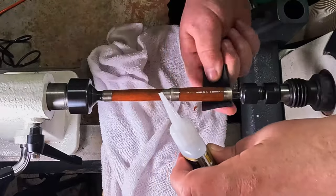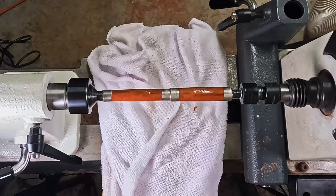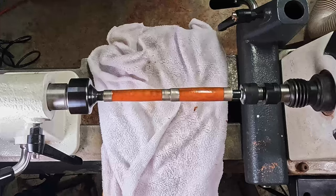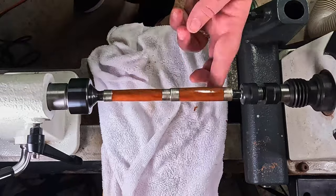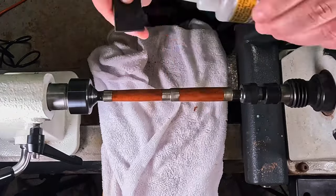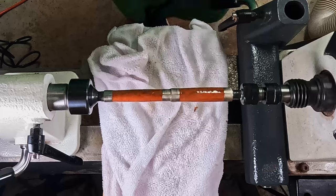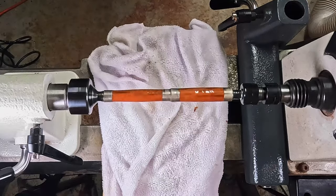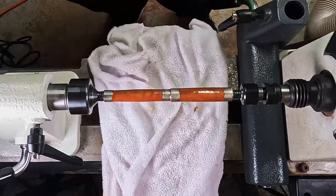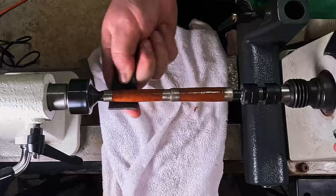It looks like I missed the start of this unfortunately, as you can see the finish is already on. I'll go through a few layers of thin superglue — I use BSI, Bob Smith Industries superglue — and it comes out quite beautiful. It really does accentuate any of the chatoyance in the wood. I do three or four layers of thin and then one to two layers of medium, which leaves a relatively thin but hearty finish after polishing.